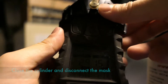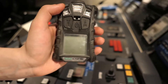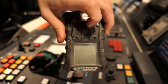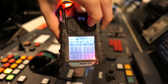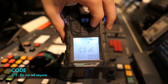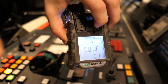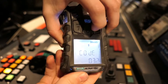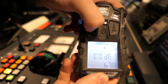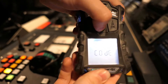Now you may disconnect the calibration cup. To adjust the device parameters, it is only possible while in device setup mode. To access the device setup, press and hold this key while the device is turning on. You enter the code mode and have to select the standard code, which is 672. The fastest way to do it is to press and hold that key and wait until it gets to 672.